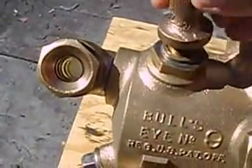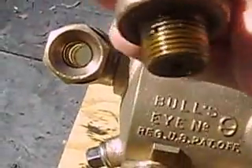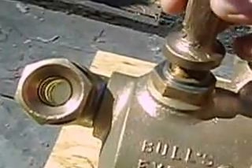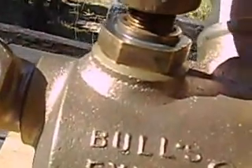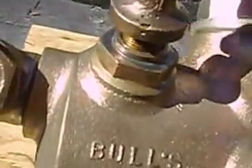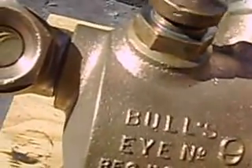One little trick these had: if you look, there's a hole in the bottom here, and that port goes through so that once you open it up, if it was still pressurized, this would blow out whatever steam was left inside before you got it all the way off. That way, if it had a lot of steam, it wouldn't fly across the cab or hit you in the head — you would know it still had some good steam pressure.